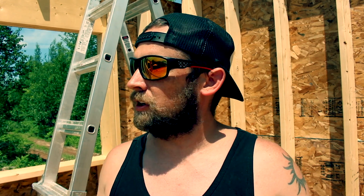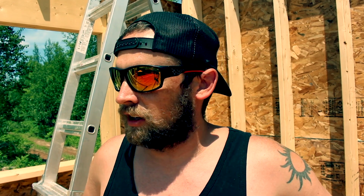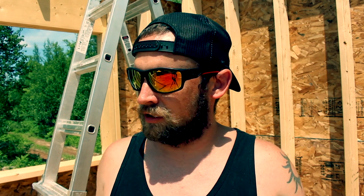Oh, another thing is I have the trusses coming in a week and a half. I was just talking to the guy today, so I'm getting prefab trusses. I think it'll work out to every 2 feet. It's 24 foot, so it works out to 13 trusses or something like that. The timing sounds about right, because we'll bang these walls off, and then within the week I'll throw in a couple partitions, which is a lot easier building. It's just smaller stuff, and it's not sheathed, it's just frame, so it's a lot easier.